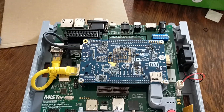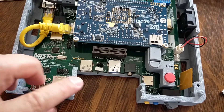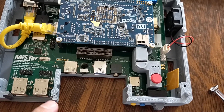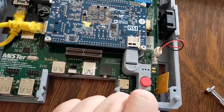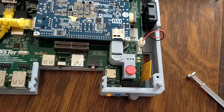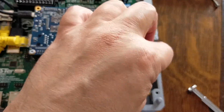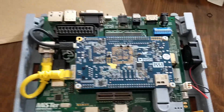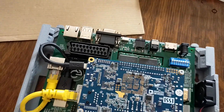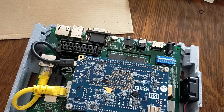Here is the motherboard dropped into the case and slid in. This wall here could do with a bit more tolerance, because I actually snapped it — but I don't think it's too bad, it's just about holding on. I could always 3D print myself a new base if needed. The switch works nicely and everything looks nice and natty. Currently I've got the fan at 3.3V, but I think I actually moved it to 5V — it will be noisier but will keep the case really cool. This connector here I don't like: as you pull on it, it twists the connector a bit, which is something I'd like to see changed in future versions.